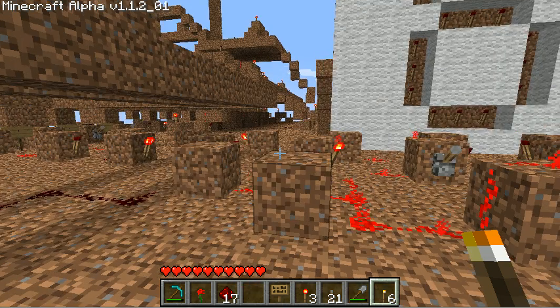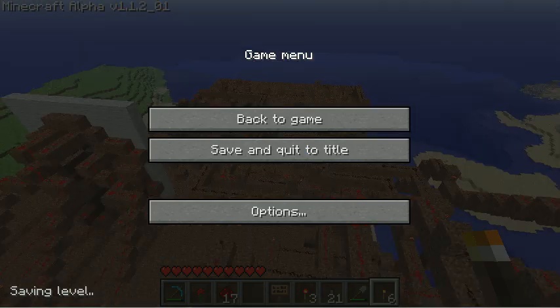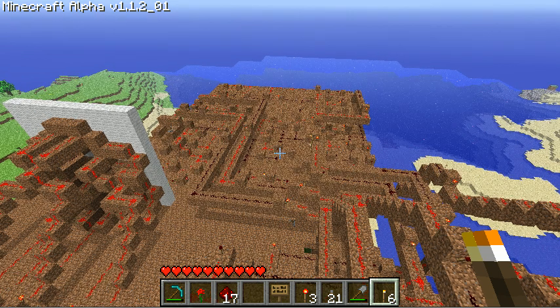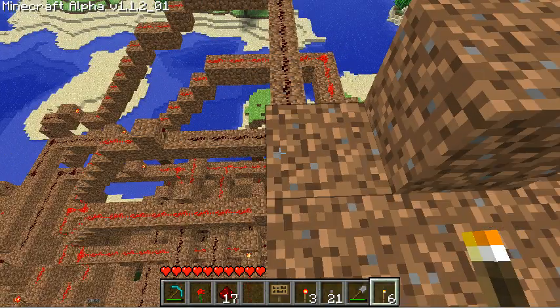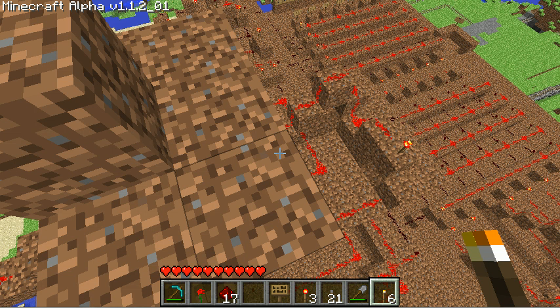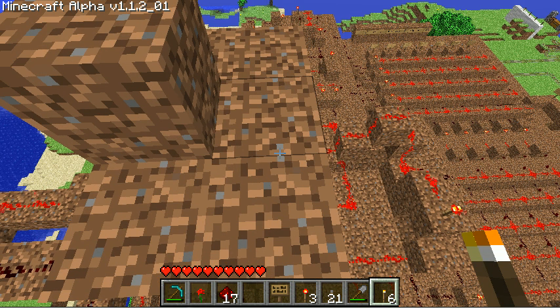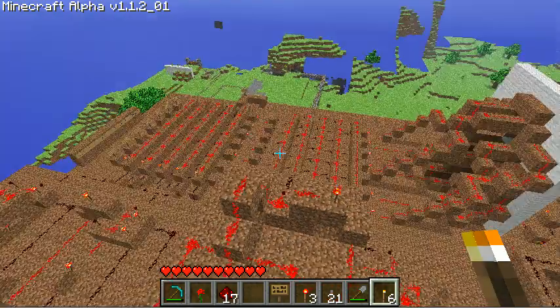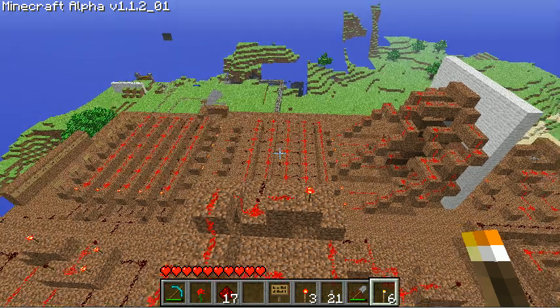That's pretty much it for the counter. I'll give you a quick bird's eye view of the entire thing, and then we'll wrap this up. Off in the distance, you can see the counter. You can just barely make out in front of that white board the blipping of the timer as it goes around in circles. Directly underneath me are the logic gates where the 4-bit binary input is translated into the decimals, and right there we have the decimal decoders, which show how each number actually appears on the display itself.